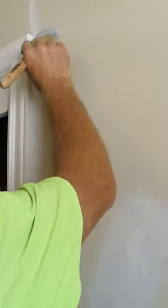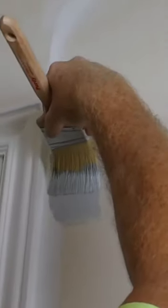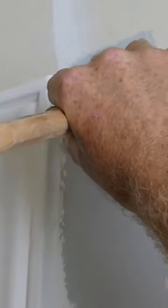When I'm starting to paint trim or anything I'm doing with cutting in, I like to get a little paint, not all the way up against it yet, just work my way out of it. Then I'm going to come back into it and just keep cutting that in until I get the line that I want.